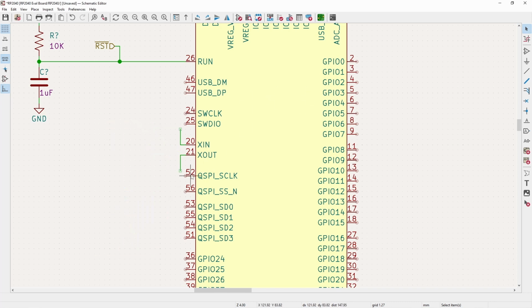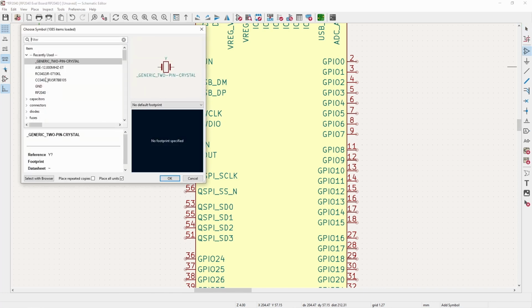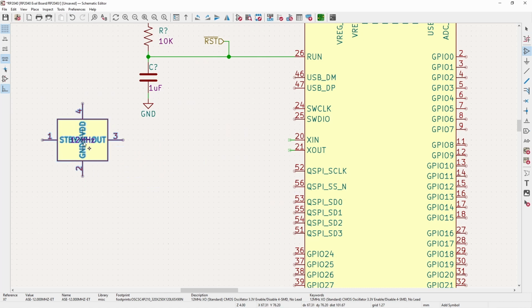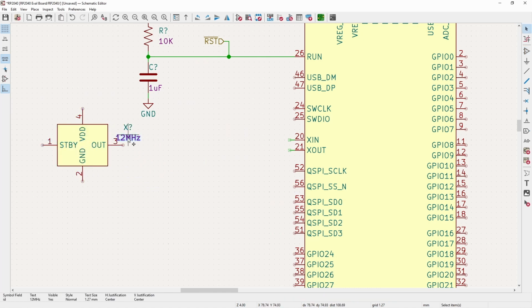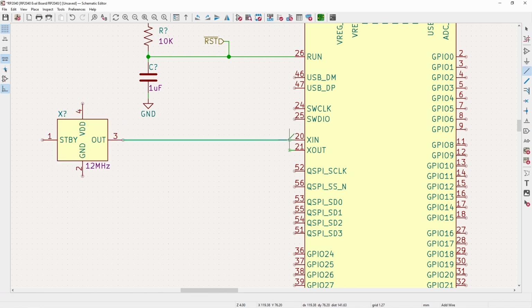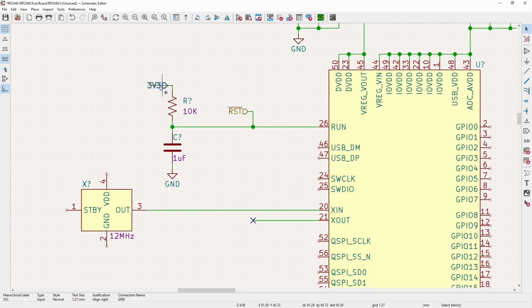But especially for projects that we'll do at work, if it's an expensive, low BOM count or low production number board, instead of doing that, I will almost always throw in a powered oscillator. And I think for hobby boards, it also makes a lot of sense because if you're just building a handful of these, what's an extra few dollars for an oscillator? It doesn't really add anything to it cost-wise.